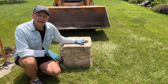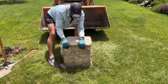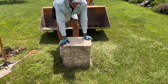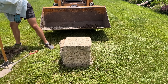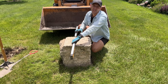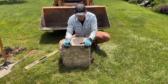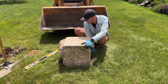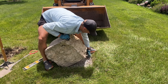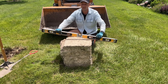See why it makes it easier with the skid loader — I could not move this alone without it. Now that it's on there, I gave myself a little wiggle room on each side. When you put it on by yourself, a little bit of the stone moves. Now the ultimate test is getting a level. That way it's actually quite level — I'm kind of shocked. Honestly it's working out really well; it's only going slightly up in the front. With this rock base under it, all you need to do is move it around a little bit and add a bit of rock in front. Rocking it back and forth like that is much more doable.